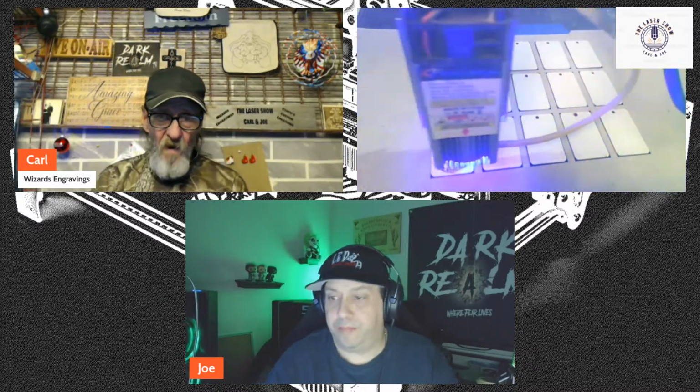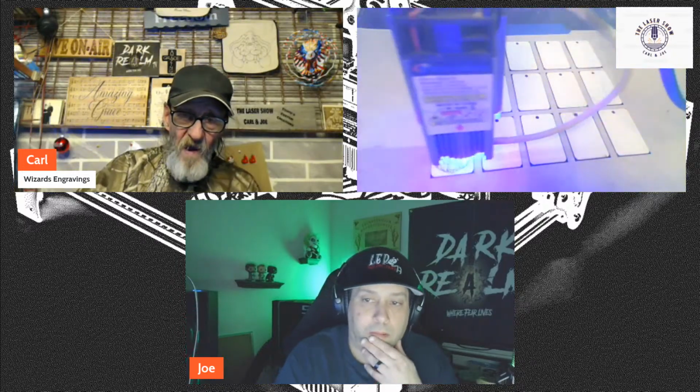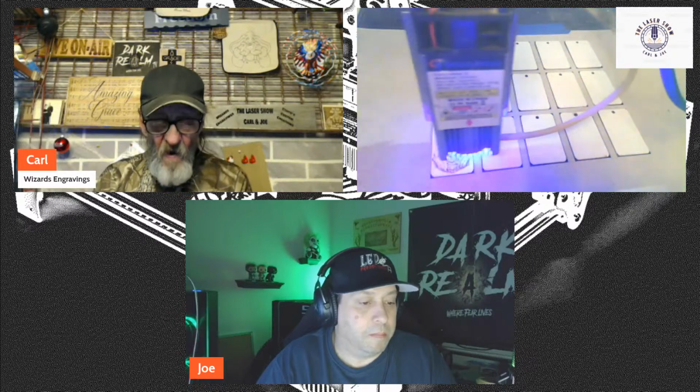Well, a lot of times when you're cutting stuff like that, and especially with the littler lasers, you've got to adjust your laser head down about half the distance of what you're cutting through. Now, with your guys's, because you're so close to the wood with your little red lens on, it's hard to do that. Mine sets up a lot higher. I can go down. If I'm cutting a 1/4 inch piece of material, 5 millimeter, I can lower it down about 3 millimeter from the normal height and let it cut through. It'll cut through and then still have the power to go on through it.